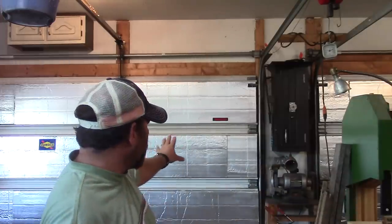I'm really impressed with how cold it is. My garage is about 600 square foot. I have 9-foot ceilings in here. It's insulated very well, including the garage doors. I've recently put up 2-inch foam board because last winter was just so cold out here. And this 18,000 BTU really is more than enough. In fact, they recommended the 12,000 BTU, but I kind of oversized it.